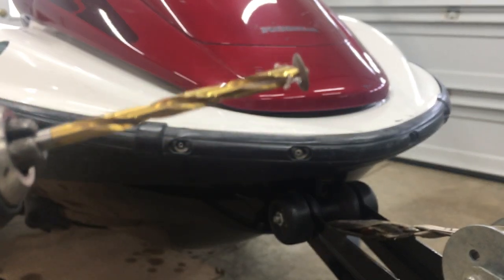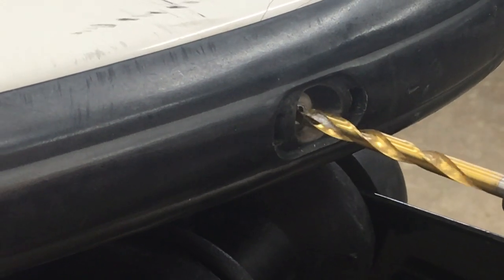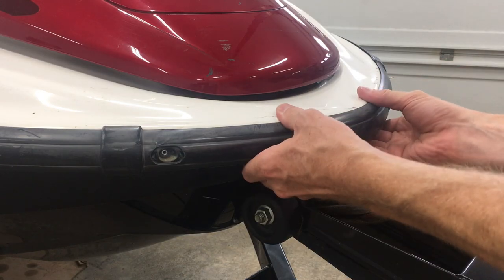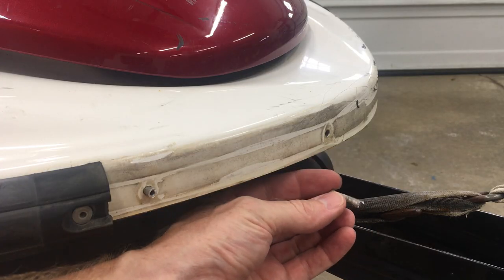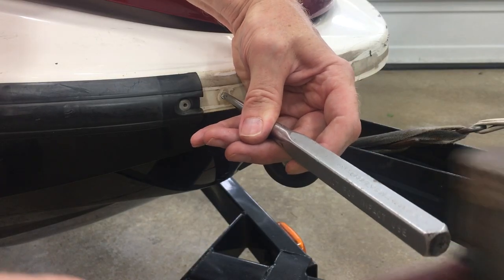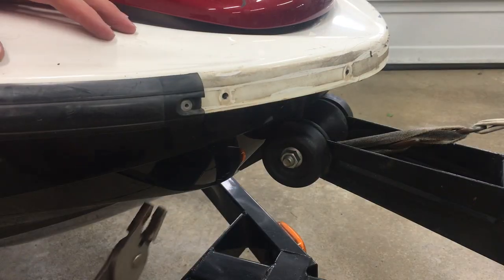As soon as you get to the point where the head comes off, stop drilling. Here's a closer look. I actually pushed the pin through on that one. After I drill out the front four rivets, I can just pull this section off. Here's that pin that pushed out earlier — I'm using a punch to push this one through. That was a tight one.